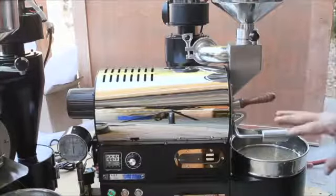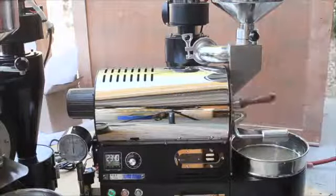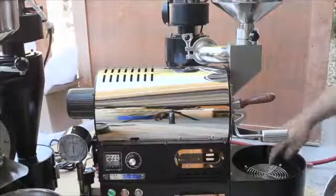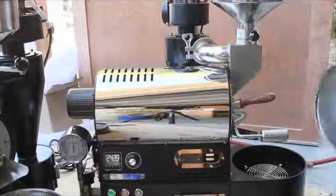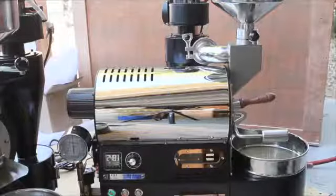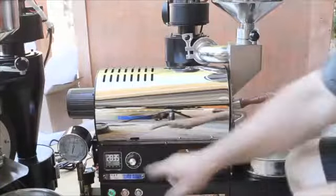The life of any coffee roaster is the airflow. If the airflow is ever cut off, you're going to have problems. Always make sure the mechanisms for cleaning and for the fans are open. On this particular roaster, the cooling tray pops off and there's a fan right here — just make sure it's clean, vacuum it out after everything's unplugged, and keep the perforated stainless steel clean. You'll have a roaster that lasts for years and years.